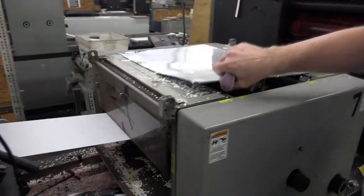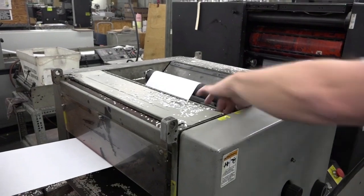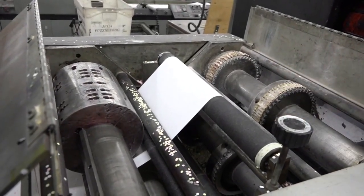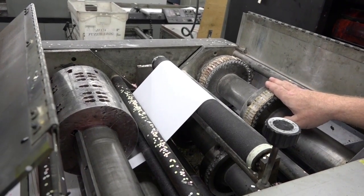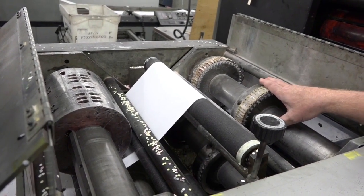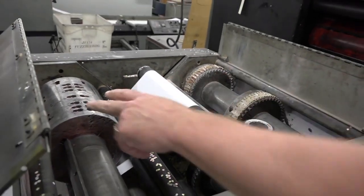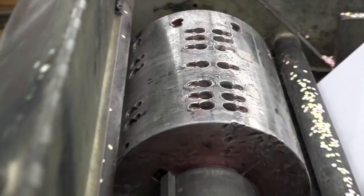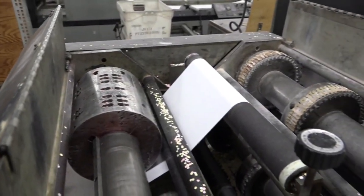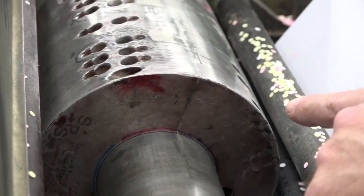The next unit is a punch unit. We have our punch cylinders. These rings put on our pin feeds, which holds our registration through the other equipment. It also facilitates pin-feed tractor feeds on printers for continuous forms. We run these on every job that is a multi-part — we may only run one side, but both sides if it's a continuous form going into a continuous printer. This is our file hole ring. We can do custom punching on that ring for bindery-type situations. All standardized punching we'll do on press; if it's out of standard, we do that offline.